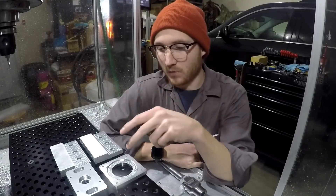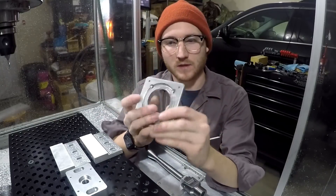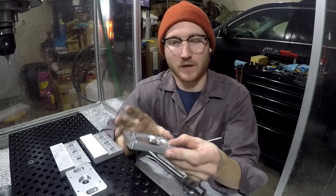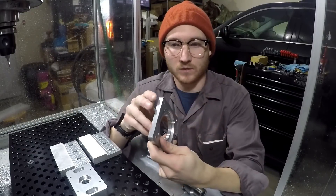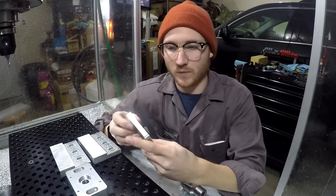Like I was saying, these parts, when they're already cut to the thickness, there's nothing to hold on to in the vise — they're a lot more time consuming to machine. I had to stick one side out of the vise and get the contours on the outside, and that was really the hardest part. Milling it to size was also one of the harder parts to do, so they're just a little bit more time consuming than normal.